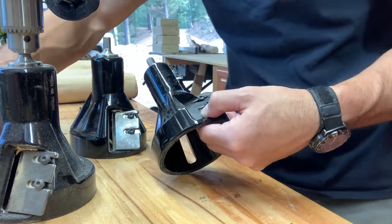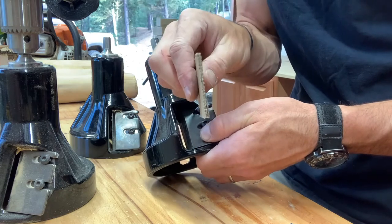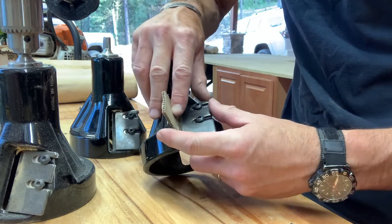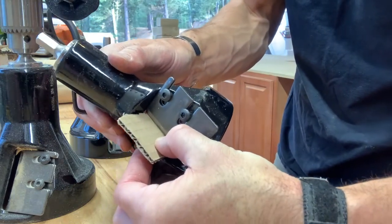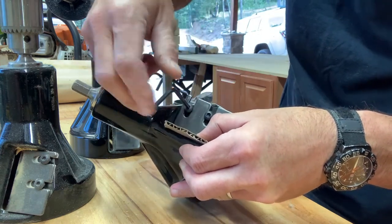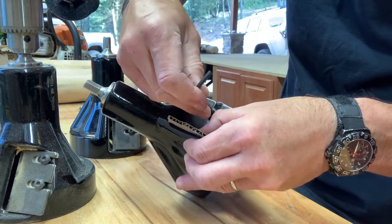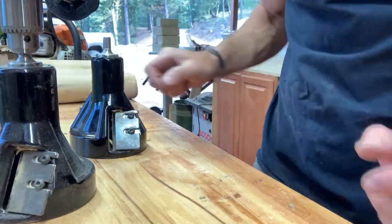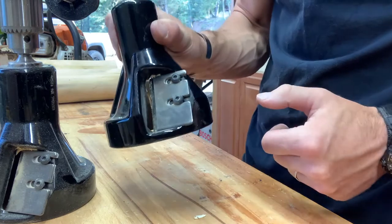And then what's important on spacing is we don't want this too far out or too far in. And so if we take a piece of cardboard, in fact, the cardboard box that the kit comes in is the perfect depth. We'll just hold that there like that inside that groove, and we'll push this blade right up to it, and that'll create the perfect depth for our blade. So we get a nice smooth, not too aggressive cut on that tenon. You'll do the same thing to the corresponding side, and you'll end up with something like that. Careful on those blades, they're pretty sharp.